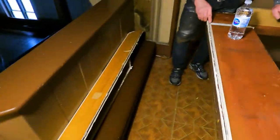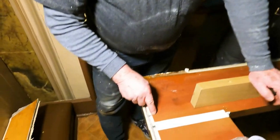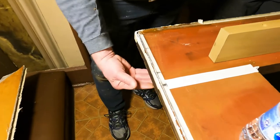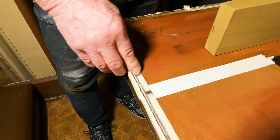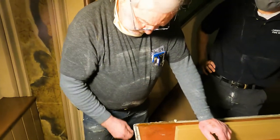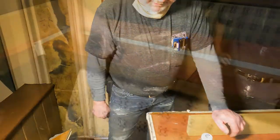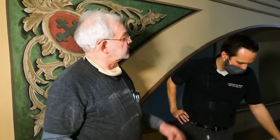You see these dirt tracks, like there's one here, one here. This is a tiny little crack that opens up through the top. There was air going through that, and this acted like a filter, and that's why it's so black. And when it leaks this way, it causes this material to rot so fast. And you may know those top panels we took off, and we looked at the gaskets. There's several places where they weren't tight, and they were leaking pretty good.